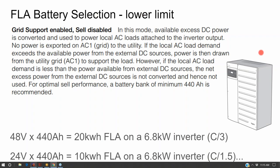On your high-end battery inverters, they have a mode to detect when the inverter is outflowing onto the grid and to curtail the power from that. I don't like that methodology because even though you're using software to curtail the power, the utility will still consider it to be grid interconnected. So if they have additional fees put on interconnecting solar to the grid, this mode will not get you out of paying those fees.